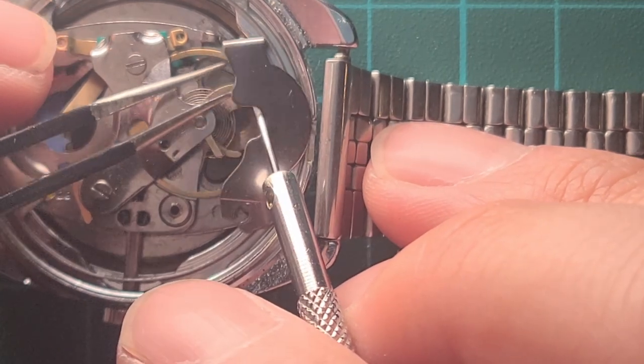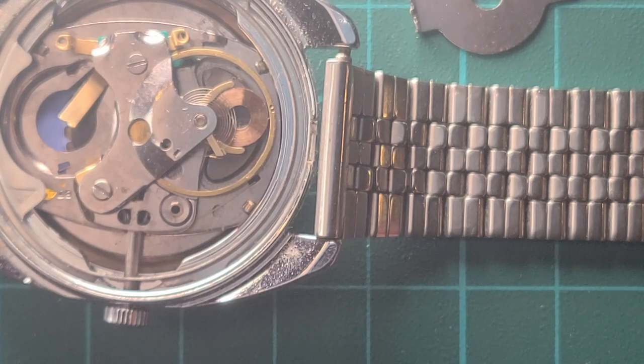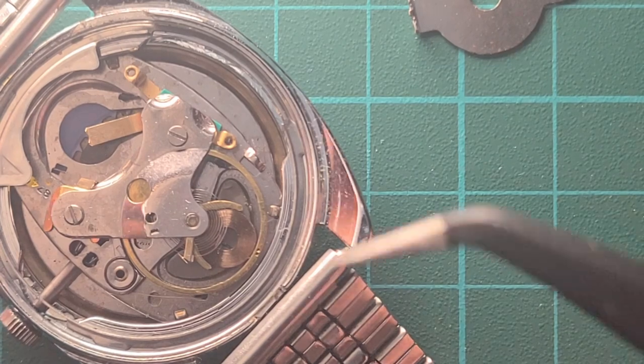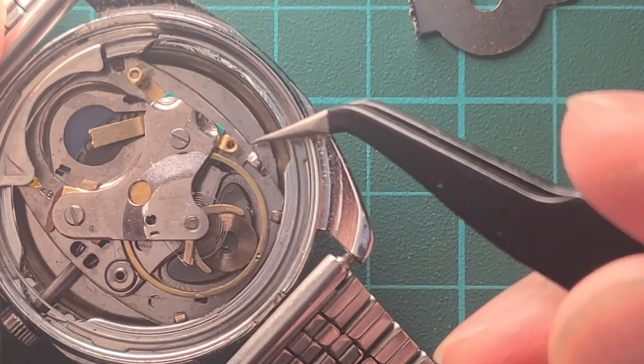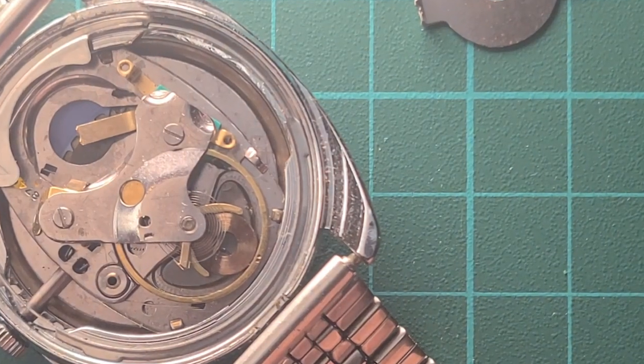So just do that again. Get the bridge unscrewed, lift it up, move the bridge in a bit, and then using another tool, try to lift the bridge upward while pushing it towards you. Once it's out, awesome. Then you can simply replace the screw that the shunt bridge was on, because you'll need to remove the two other screws.